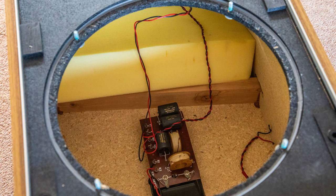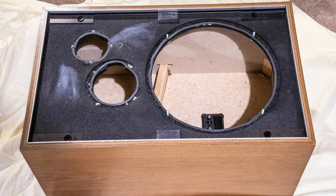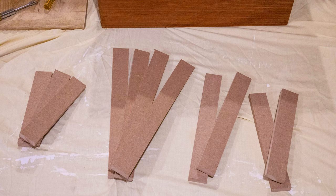So I set about taking the speakers apart again. All the speaker units came out along with the old internal foam that most speakers use inside to cut resonances in the enclosure. You can see the empty cabinet here and the single reinforcement across the back, which wasn't really sufficient. I used MDF board cut into strips for the reinforcing braces, as this was supposed not to flex or resonate too much. Remember to wear a mask when cutting MDF, and if possible cut it outside as the dust can be harmful.